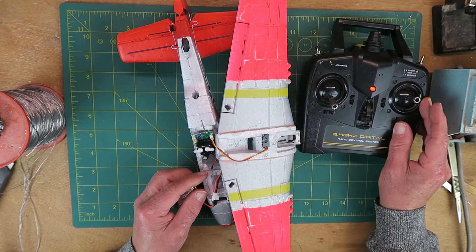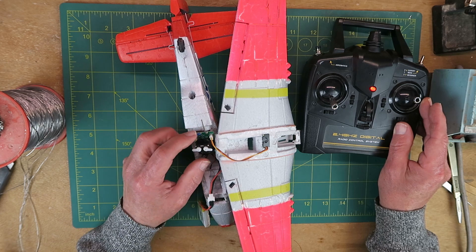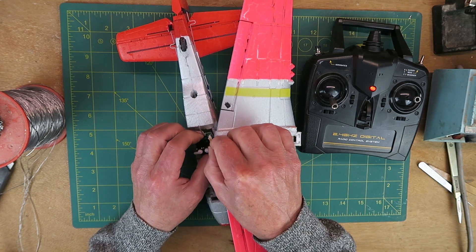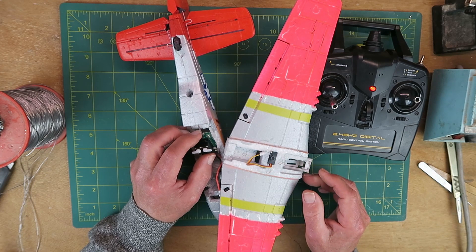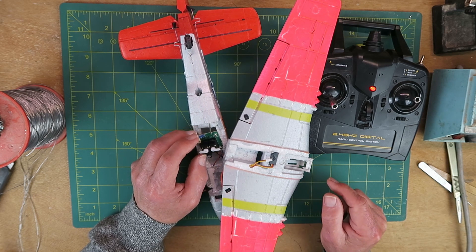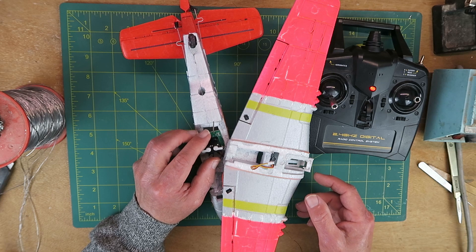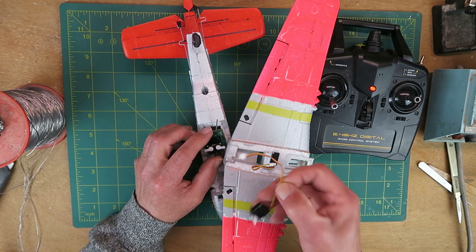I'm still following in the steps of my guru, AirDoggy over there in the States. He is convinced it's to do with the signal wire or the servo. Let's disconnect the battery and take this servo off. Not forgetting that the servos were connected backwards as well for a time — probably longer than the regulator, which would have blown pretty much instantly. The servos would have been connected backwards for however long the guy had it that way. I have no idea.